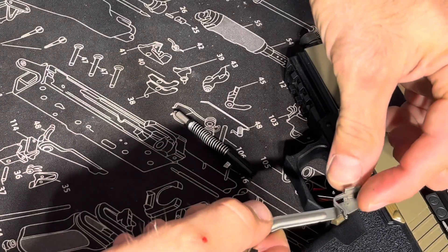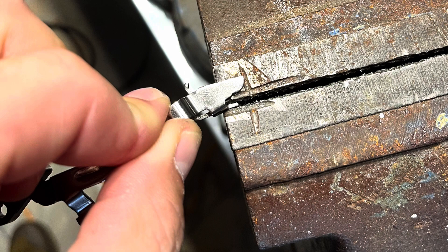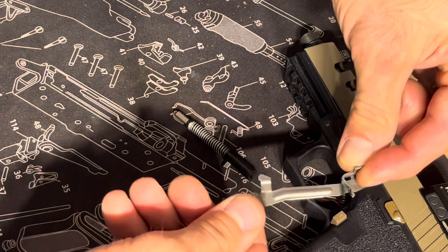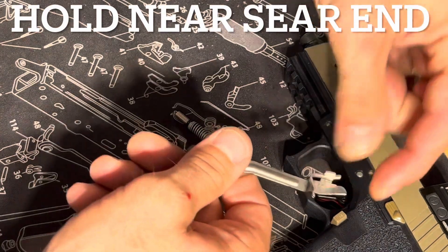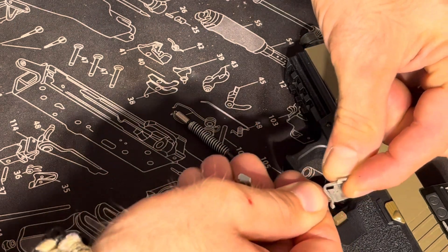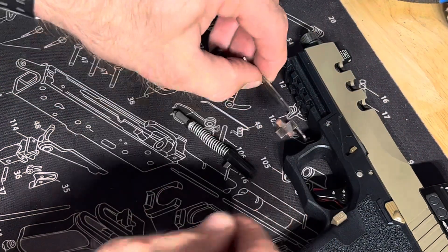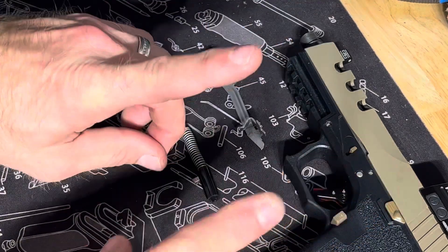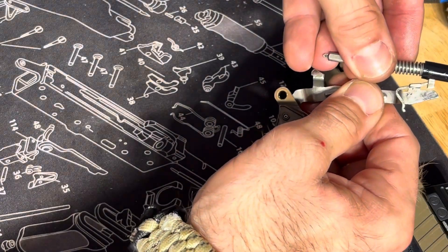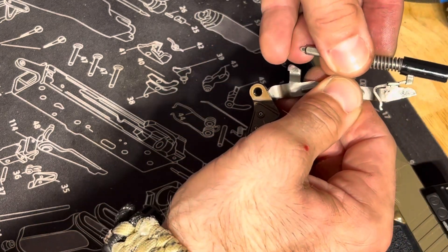Then I stick it in the vice — I'll show you a picture in just one second. Basically you tip the back part up. You don't want to hold down here because that puts a lot of torque on there and you will snap this part off. You just want to tweak the angle just barely by holding it up here and tweaking it. It might take two or three times because you don't want to overdo it — that makes your trigger travel way too long. This is the best way to fix it and the number one cause of why your trigger doesn't reset. Your trigger bar will be sitting higher, it will still fall and fire forward, then it grabs more of the sear and lifts it back to where it should be for proper operation.